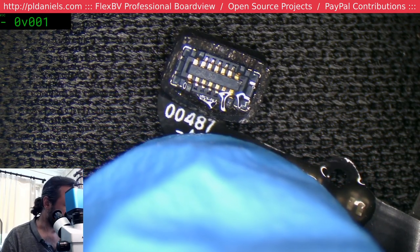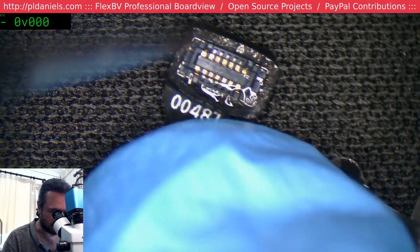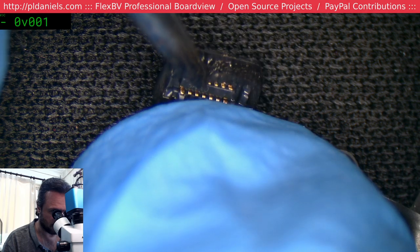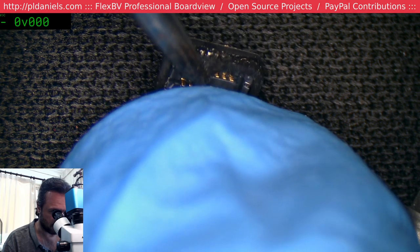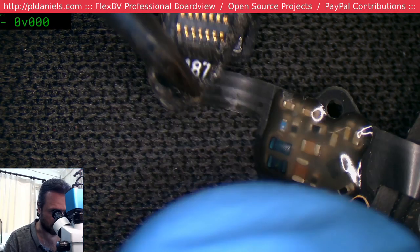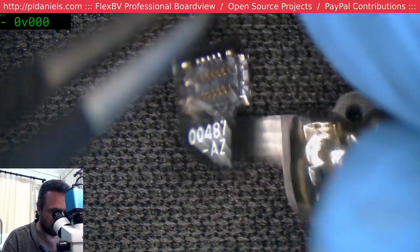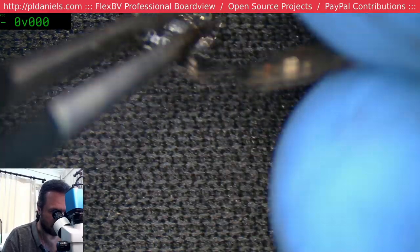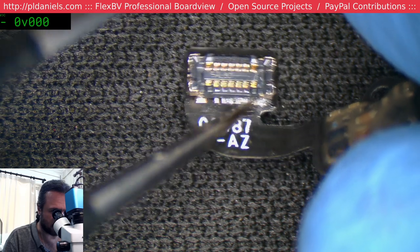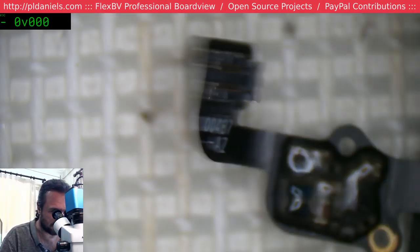Okay. The alcohol just lets me get it off a lot easier without it sort of sticking and tearing. Usually. Kind of mangling this job up. There we go. Okay, so we can see we've got the corrosion here. Man, why can't I seem to handle this? And that's pretty bad. I guess what's happened is it's wicked up to the outer side, but it hasn't gone to the inside. So I suppose that makes sense then, that it didn't show up on the screen side one.